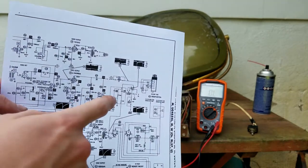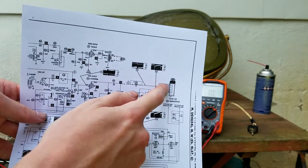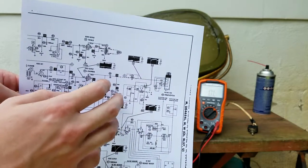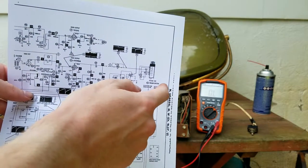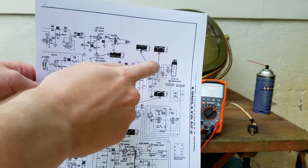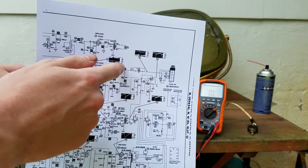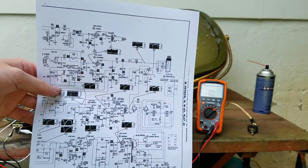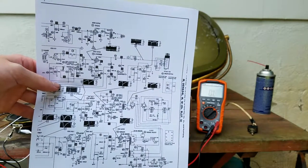Let me explain what I'm doing. This is the cathode of the CRT that comes out on this wire - that's usually where the video signal goes in. In order for the tube to work at all, this has to have a path to ground, because the current flows from the high voltage electrode down to the cathode through the tube. It comes down through this little choke, through the 220K resistor to the brightness control, then to ground. If this path is broken or has too high a resistance, you're not going to get any image on the screen because there's no way for current to flow through the tube.